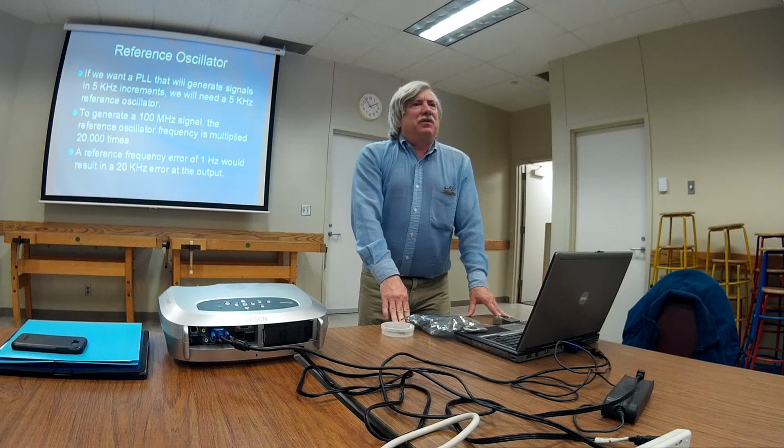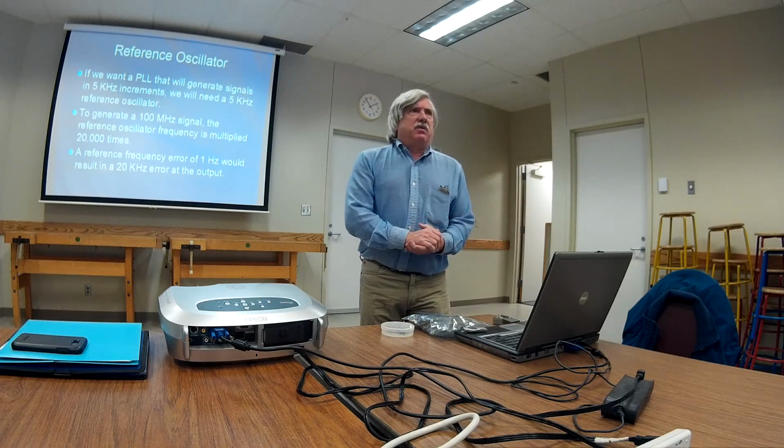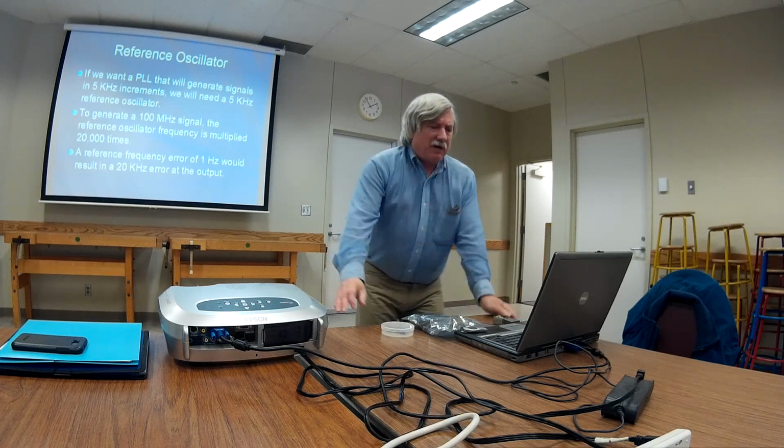We want to generate signals in actually like 5 kilohertz steps. There, we can generate signals in 1 megahertz steps, but I want to be able to program a frequency like 146.415. Well, that 5 is 5 kilohertz, 5,000 cycles per second. If you wanted to generate a 100 megahertz signal and you had a 5 kilohertz reference oscillator, you would need a divide by 20,000 in the divider, which will give you a multiplication of 20,000 times.